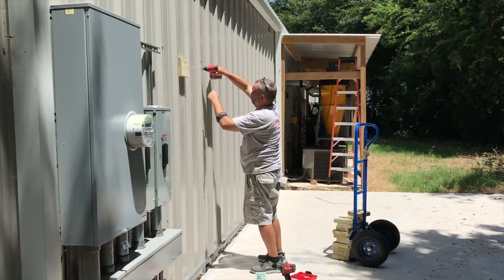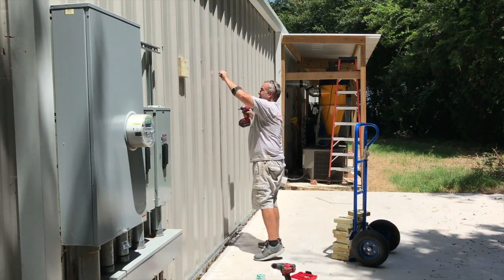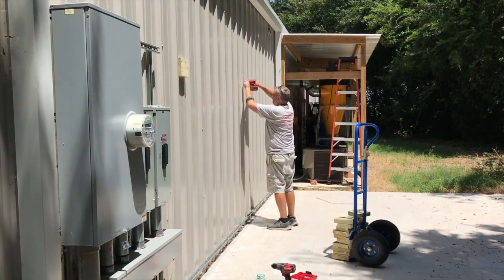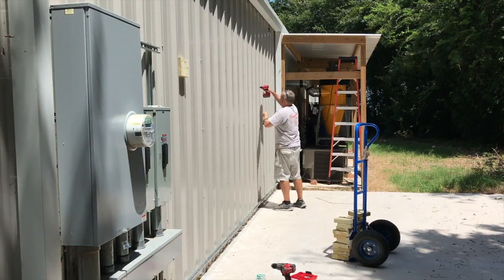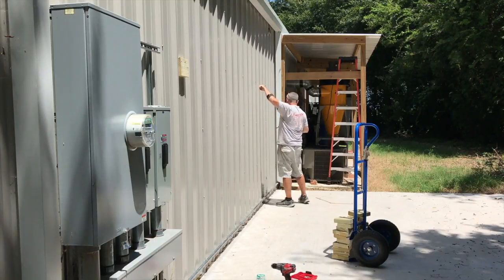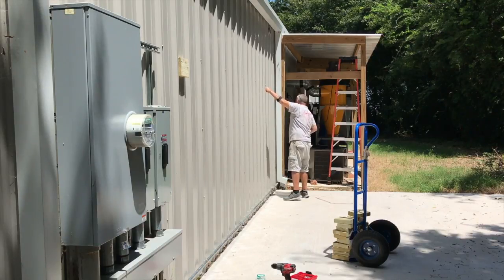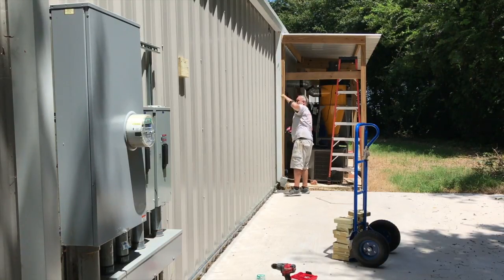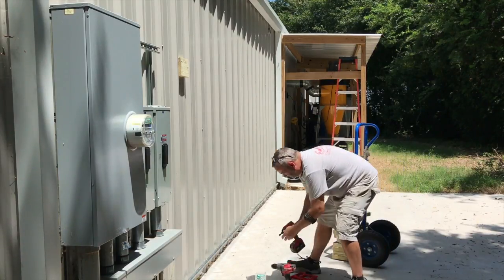So these R panels have corrugations that are about 1.25 inches thick, I believe. So I needed to be able to attach to that, and there is a horizontal purlin running the length of the wall there, and you see me removing the screws where the panels are screwed into the back of that purlin. So I wanted to attach the back wall of the paint booth to that purlin and secure it, at least to the extent that I can. So I made up these pressure treated blocks to go in there to get those spaced out.